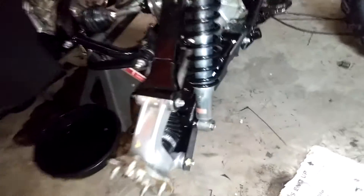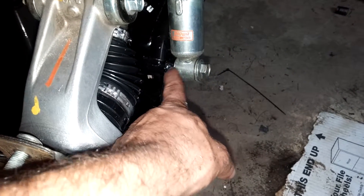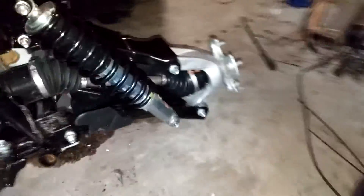Some pro tips on this bike. Always, every time you take the shock off, grease the piss out of the bushing in here. There's the little sealed bushing and thingy, and then there's a washer on your side. If you don't grease it, water's going to get in there, and if you ride in water, it's going to wear out and clunk around. So grease it every chance you get.